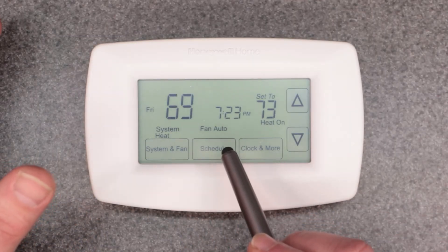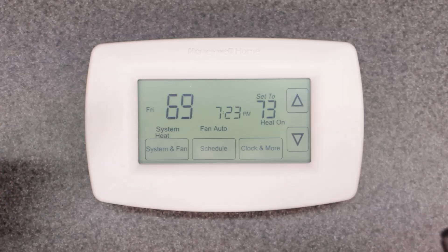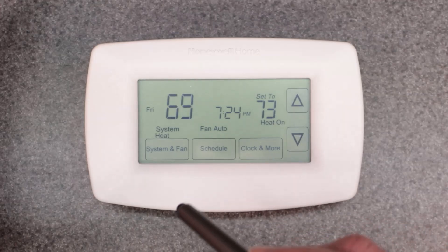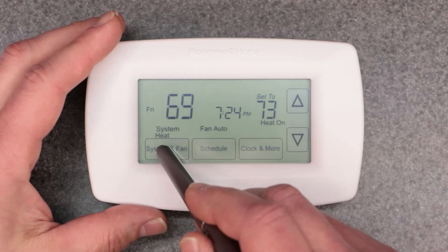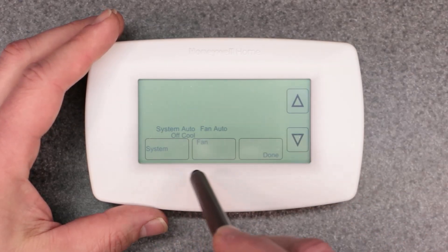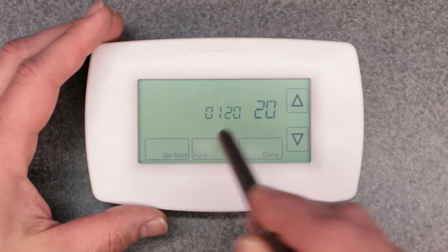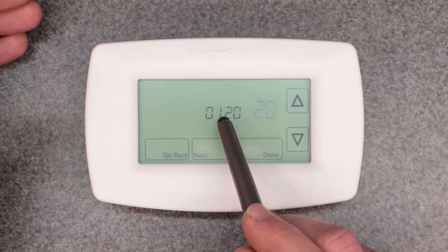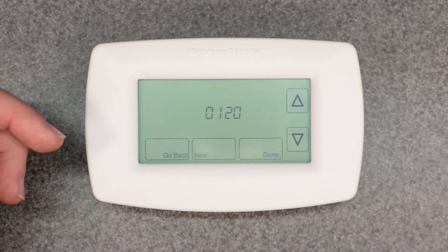You have to change the settings manually in order to factory reset it, and that's the only way. I can show you where that is, but I'd encourage you to check out my setup and install video on this thermostat — I'll link it in the cards above. It is a hidden menu, and to access that hidden menu you have to first click on the system button, wait for the screen to change, then hold down the fan button. Once you do that it brings up a function number and a setting number, which I cover in detail in that other video.